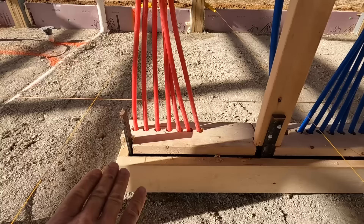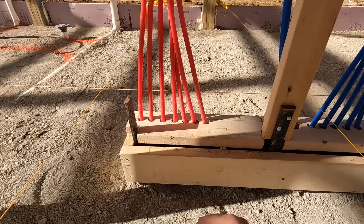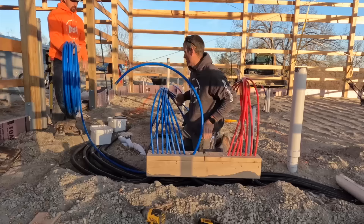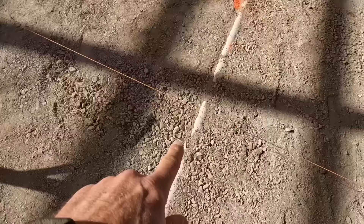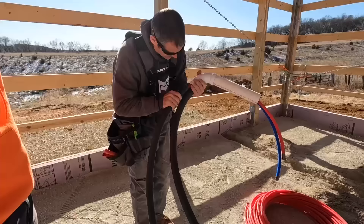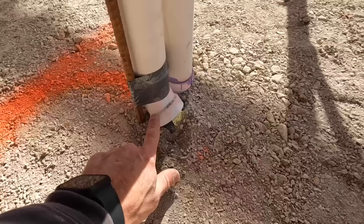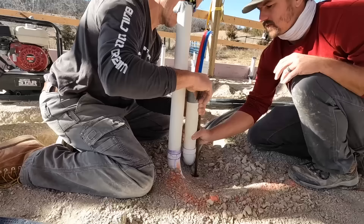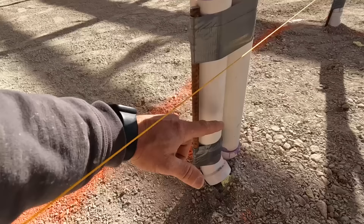There's no right or wrong way to do it — this is the way I choose. If I ever have a problem, there are enough lines running to each spot that I could branch off or cut out some drywall and add a line in. From that box, I will insulate the lines and run them over to the locations of sinks, using a 45 or long-turn 90 to run the PEX tube up into the location I want. At the bottom of the 45 where the PEX enters the PVC, I always fill that with spray foam. You can see I use a piece of half-inch rebar to hold it in place. That way, when the concrete gets poured, the PEX is completely protected and not contacting the concrete. And before the concrete guys come, I always tape off the top so no rock can get in and wear a hole in your tubing over time.